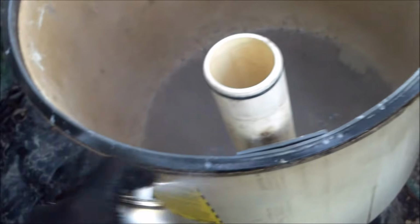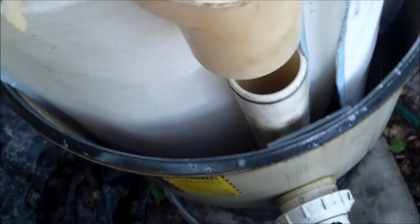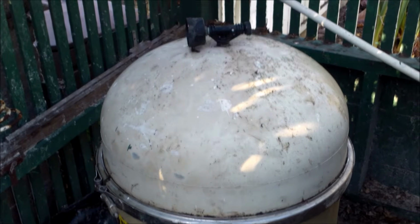Let me go ahead and lube up the stem O-ring. I just changed that one also. And the tank O-ring here. I'll get everything back together. See, everything's good. If you build everything correctly, you should be able to slide the filter grids down the top manifold over that pipe there. It should slide right in there with no obstruction. That's a quick look at a more difficult way to rebuild a top manifold filter.